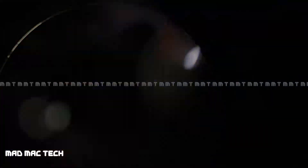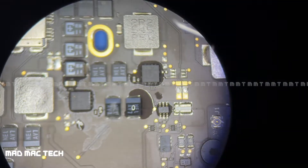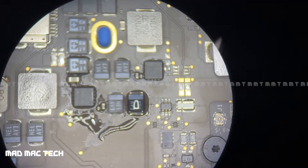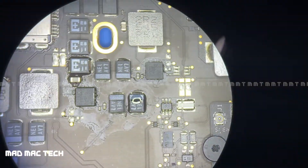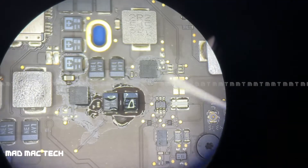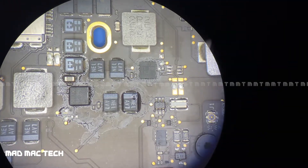This is the area that was getting hot under the thermal camera. You can see alcohol is sizzling away on this particular capacitor, while the alcohol on the adjacent cap remains intact. The capacitor from which the alcohol is evaporating quickly — that is the problematic cap causing the short.